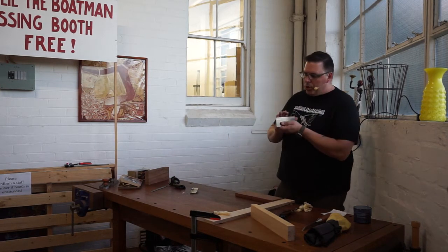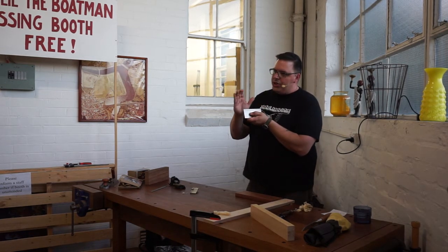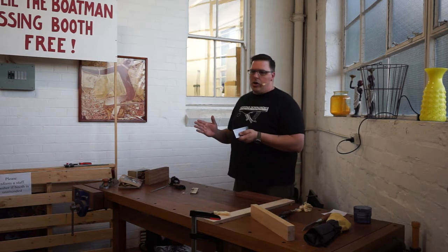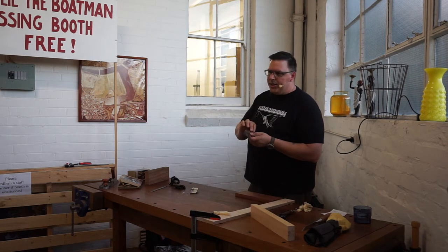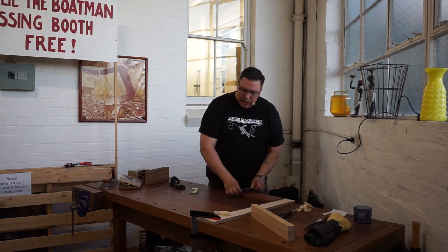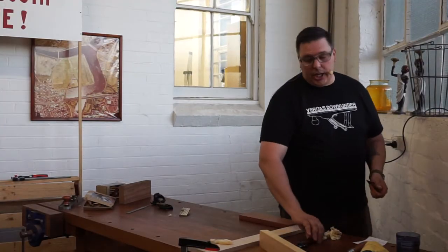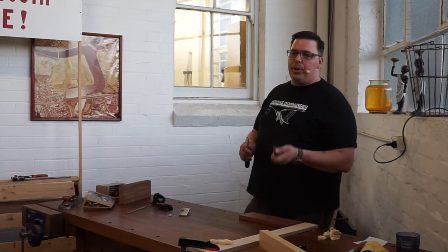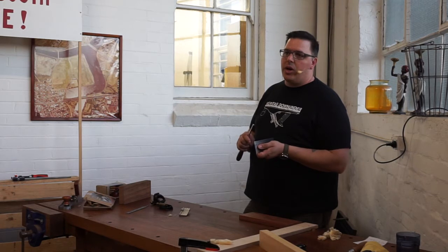Typically what people do when they put a hook on there — when you're using one of these, you actually want to bend the metal over just a little bit at the edge to create a hook. What happens is people put it in a vise and then lean on it and put what I call the tsunami hook — this massive curl at the tip. To get it to cut, you've got to really lean the thing down, and it's not comfortable to use that way. What I learned from a chairmaker in the United States named Brian Boggs: he said to turn the burr with the scraper in your hand, not in a vise, because you can't push hard enough to cause that problem.